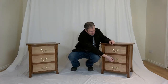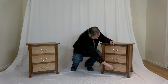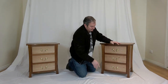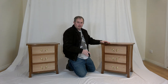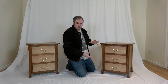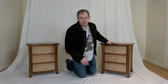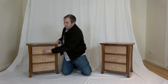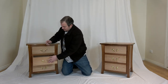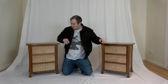Except for the drawers — some of them are kind of sticky. They work, but kind of sticky. The reason is that with traditional drawer runners, any seasonal movement from weather causes them to swell or shrink. Right now all the drawers are swollen just that little bit, so they're all a little sticky at the back of the stroke. I could shave them down a little bit more, but I think I'm going to leave it as is because they all work — they just don't work perfectly right now.